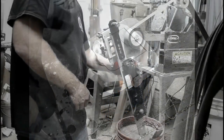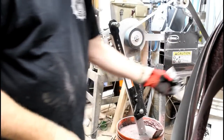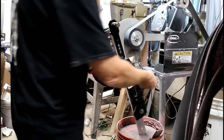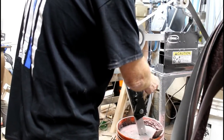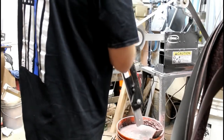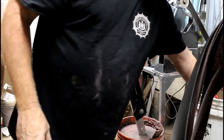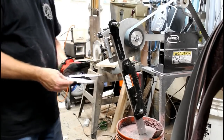What I did learn is that the scale cleans up pretty easily. I use a surface grinding attachment from my Oregon Blademaker 2x72 grinder, and I surface grind all of the blades after heat treating. These are the tool wrap blades as well as the aluminum foil wrap blade, and they all cleaned up very quickly. Even the knife that had the decarb only took a couple of additional strokes on the surface grinder to clean up the carbonization.